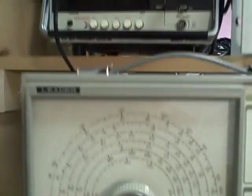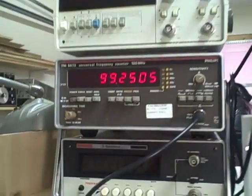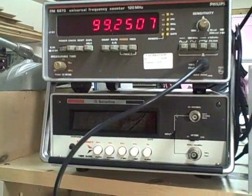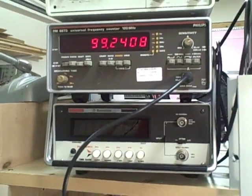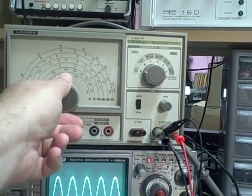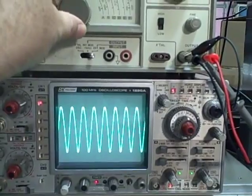Right now we're at the extreme lower end of the frequency range on band A, at the lowest point on the attenuator, and we are reading 99.245 kilohertz. There's some instability in the hundredths of a hertz area, but at the tenth of a kilohertz we're doing just fine. Let's go ahead and sweep this thing through, starting at the 99 kilohertz point. Let's take her up to about mid-band — sweeping up. 150 on the dial, and I am reading 152.2 kilohertz on my digital meter.